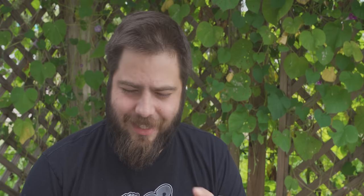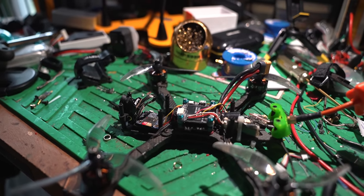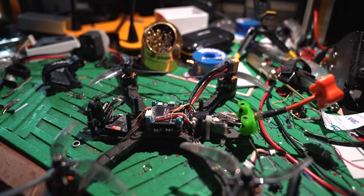So those are all the good things for me for the RunCam Hybrid. Let's talk about the downsides. First of all, 20 by 20 — I just do not like 20 by 20. I know this camera is aimed at the micro market so you want smaller boards and smaller builds, but I just despise 20 by 20, especially when you have to use M2.0 screws, which are the slightly smaller ones that you don't ever have lying around. So that 20 by 20 could be a good thing or a bad thing depending on your preference.